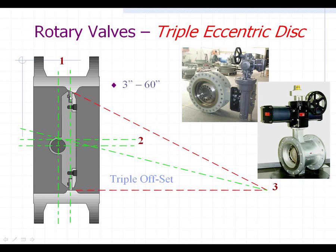As you can see, this is tapered here to meet the special seat ring, and this area is machined flat for that. What this allows the valve to do is almost act like a door closing into a door jamb. One issue with butterfly valves is that the disc and seat usually have to scrape and rub against each other to close properly, causing wear. This design ensures there's no touching of the disc to the seat except for the last one degree of closing, so you virtually have no wear at the seat area.